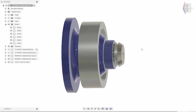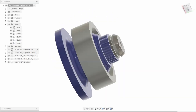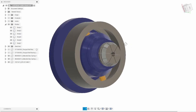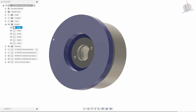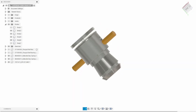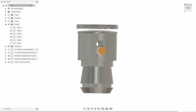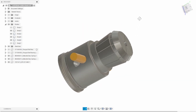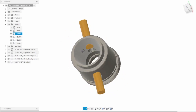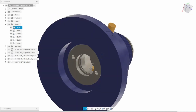Some time ago I had this idea of making a lever-action ER collet lathe chuck. There's a nut that obviously goes over this, but it's not in the design just at the moment. And the idea is that in the back, we've got a stack of Belleville washers here. And then you've got a plunger which has got the taper in for the ER collet. And there's a lock ring in behind.